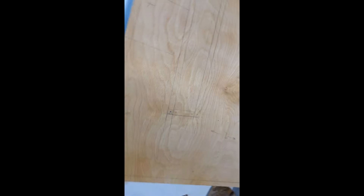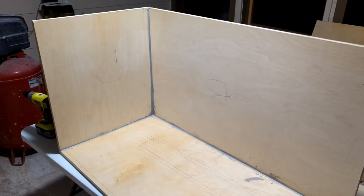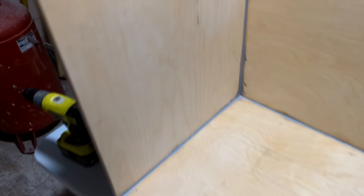Put yourself a couple of indexing holes so you know where to start. You're going to want to get your top board on and the back board on connected to that side — that will be your next step. You want to use PL glue — not this one — you want to use the 3X that expands. This max version does not expand, so just letting you know.